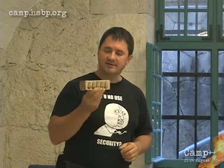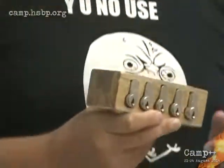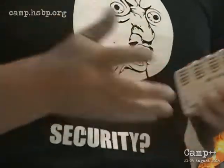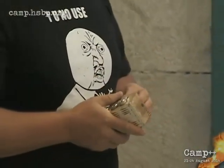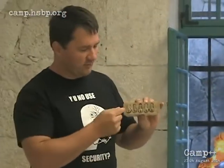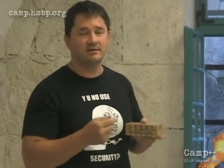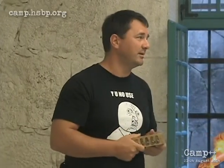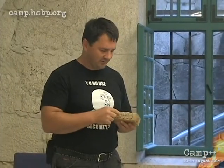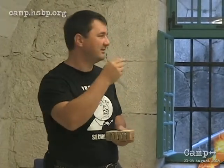The only difference that in the US the locks are upside down in the door, therefore they say lift it, we say pick it or push it. So that's the difference. Maybe they have the small help of gravitation. If one pin is picked, then the top pin is falling down, and this is a sign that one pin is already picked or set it. We don't have this help, and therefore we need a better feeling of spring and the tension.